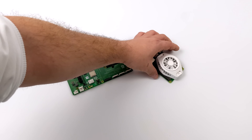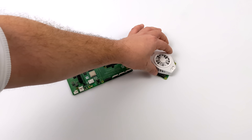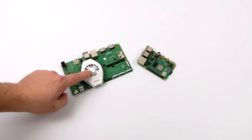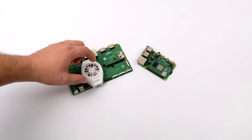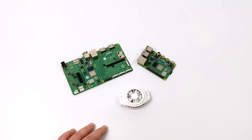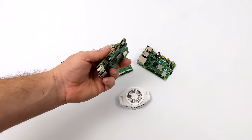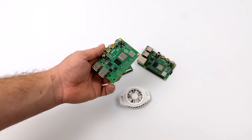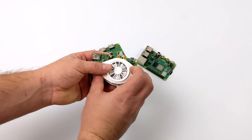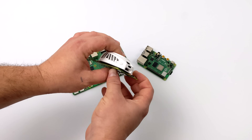On a regular Raspberry Pi, I couldn't get this to fit. I could always rig something up with a little copper spacer, and I actually thought about doing it on the CM4, but then I remembered I had a slimmed down Raspberry Pi 4 that I haven't used yet. This has the GPIO, DSI, and CSI connector taken off, so we can get right down to it — it's also slimmed down on the USB ports. This way, I can get the cold side of the thermoelectric cooler right up against the CPU on the Raspberry Pi 4 to keep it as cold as possible, and it actually fits on the board quite nicely.